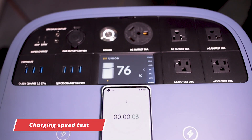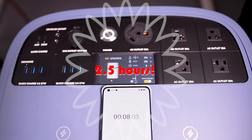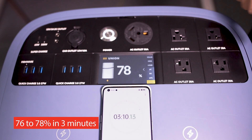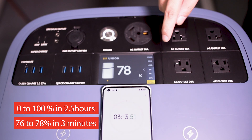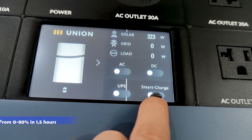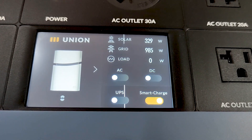The next thing I was eager to know is how fast it can charge. Mango Power claims it comes with a smart charging feature, so no matter what outlet you plug into, it only takes 2.5 hours to fully charge. I tested from 76% to 78%, which took about 3 minutes — converting that to 0–100% gives roughly 2.5 hours. Of course, with fast charging the first portion is always fastest and then slows down, so from 0% to 80% it actually only takes about 1.5 hours according to Mango Power. That's a staggering figure considering the 6.9kWh battery capacity.